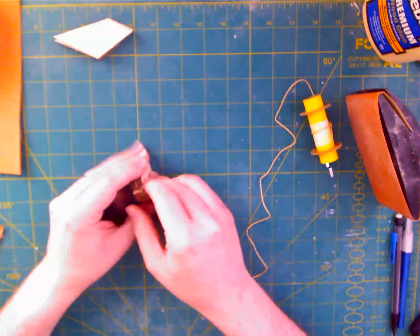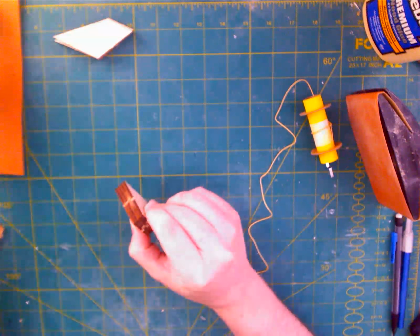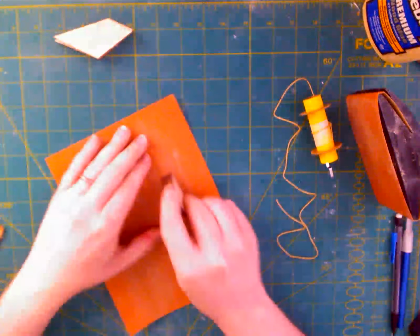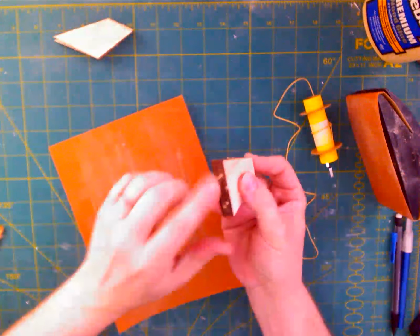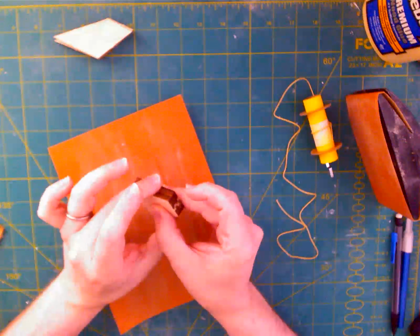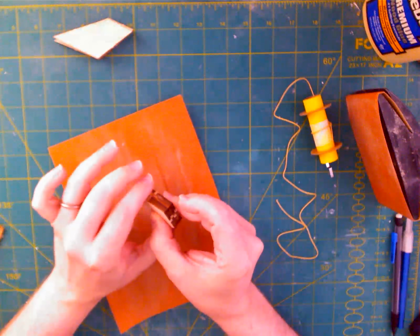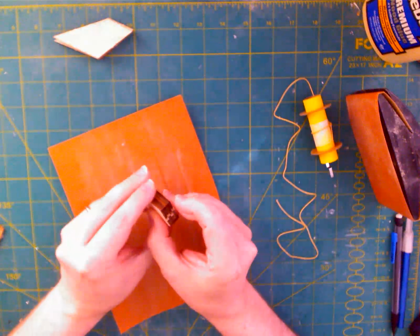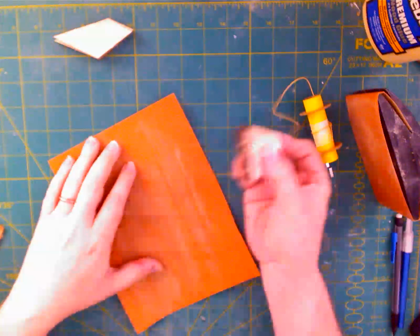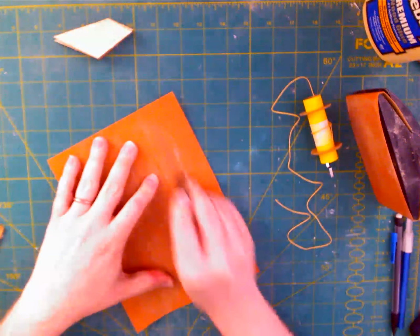So what we do need to do is all these burrs, which again are pretty big, frankly, they need to come off. Especially they need to come off the root. The front and the back faces I'm not too worried about. I'm going to sand them anyway because they are surprisingly large, but they're going to get taken care of when I round the fins. But anyway, I've lined them up and just, ooh, that makes a bad sound.